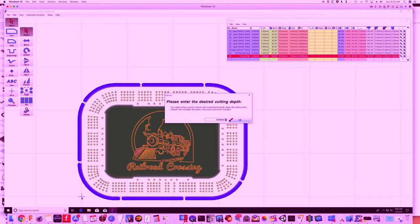Unfortunately this was an error — I had not set the depth of the holes to be drilled, so that 0.1mm setting affected the laser engraving and all the holes to be drilled. I ended up only drilling one-millimeter holes for the pegs, when it should be a quarter of an inch. I ended up totally redoing this later, but we'll continue for now.